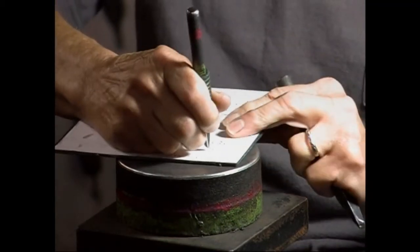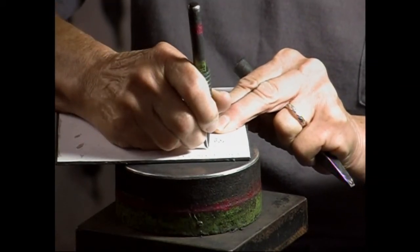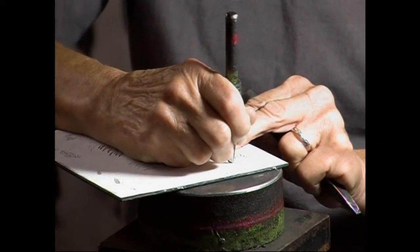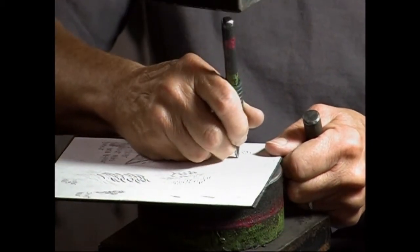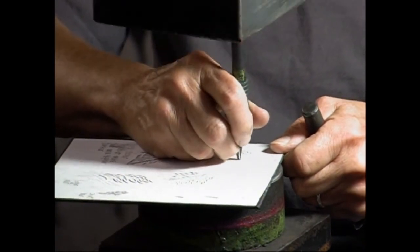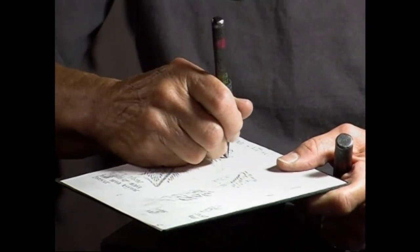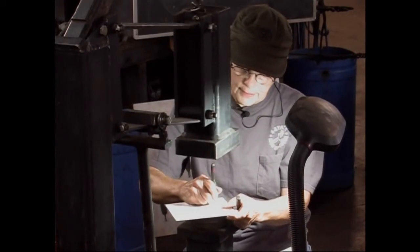I think McMaster sells lead, don't they, Mark? Yeah. Who does? Roofing supplies. Okay. Does the lead that the stained glass people use, is that suitable? Oh, yeah. So just don't go breaking church windows to get your lead. If you can find where they're tearing down old houses and you've got the old cast iron hub plumbing, the lead that they poured in that was usually pure. Just make sure you use pure lead, because the other stuff is too hard.